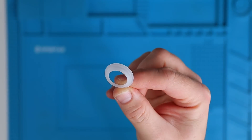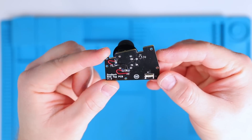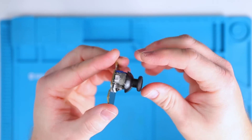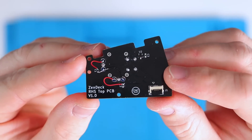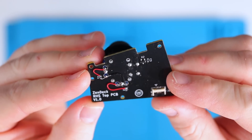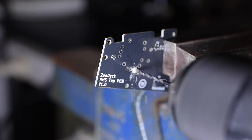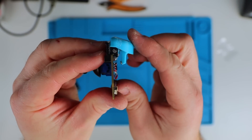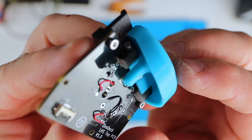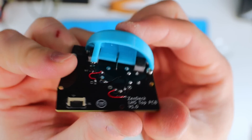Now that the housing is sorted, let's take a look at the PCBs. As usual, I've made a heap of mistakes on this first revision and I've spent the better part of a week troubleshooting and patching things up enough to get the controller working. These are the joystick PCBs — each one mounts one of the joysticks and a Hall Effect sensor for the corresponding trigger. I wrongly assumed that the Hall Effect PS5 joysticks I bought would have the same pinout as the common joysticks found in Arduino beginner kits, but that's not the case at all. The polarity on the sensors is reversed, so just to get this revision working I've had to drill out the holes for the sensor power and ground connections and use wires instead. The triggers mount to these PCBs, so there's no need for the back cover to be in place for testing. The triggers are a 3D printed part with a tiny 3x1 magnet glued to the arm, pivoting on a 2mm stainless shaft. I've used PS5 trigger springs here as they are nice and cheap and far easier than bending our own.